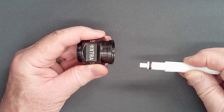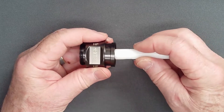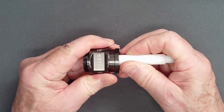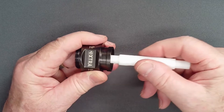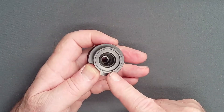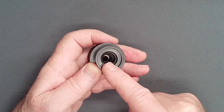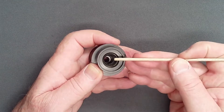Centering it carefully, push the stack into the bore of the body. You may feel a slight click as O-ring 27 passes into the narrowest part of the bore. If the steel washer comes out with the tool, drop it back into place and then gently rotate it flat with a wooden dowel rather than with the bushing tool.